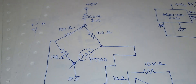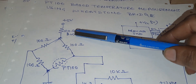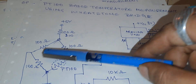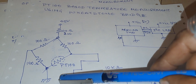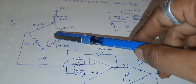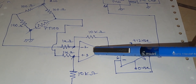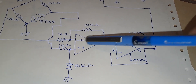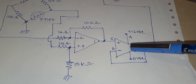I am going to show you the basic circuit diagram. The basic circuit diagram consists of four arms of the Wheatstone bridge. Three arms are the fixed arms and the fourth arm is the PT100. Whenever I am heating the PT100, the bridge gets unbalanced and the differential voltage is fed to the differential amplifier. This is op-amp LM324, a quad op-amp, and I am using only two op-amps. This is the differential amplifier and this is the unity gain buffer.